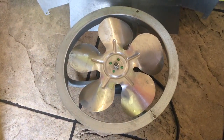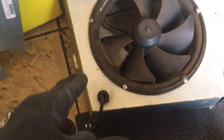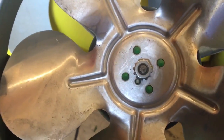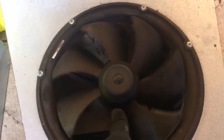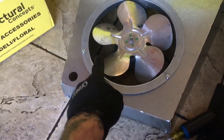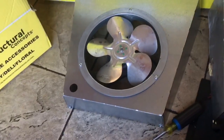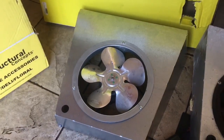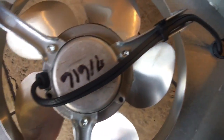There's our replacement motor. There's our shroud — we have to bend it, be kind of a tin bender. We're going to bend that up to be this box right here with our new fan. It's still an ECM type motor, but at least you can change the fan blade on this one. Broken fan blade — there's our new one built up. I'm going to get a pop-in bushing on there and some tie wraps for the wire. There it is with the pop-in bushing, and we ran the wire with tie wraps to keep it out of the fan.